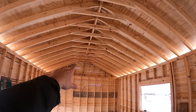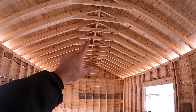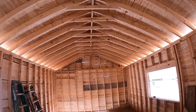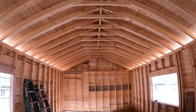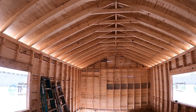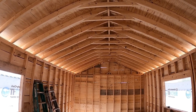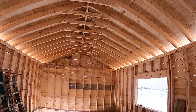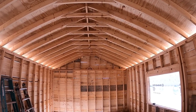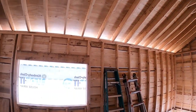Another thing I didn't really plan for was the collar ties. I originally hadn't planned on putting them there, but after we put the roof together it just looked like it needed something. With the distance these rafters span and the rafters we've got, it should stand up to a 70-pound-per-square-foot snow load. So far this winter we've had a fair amount of snow and it's holding up, which is good.